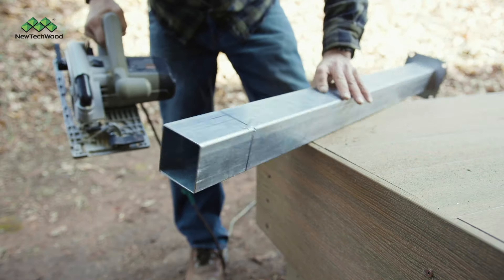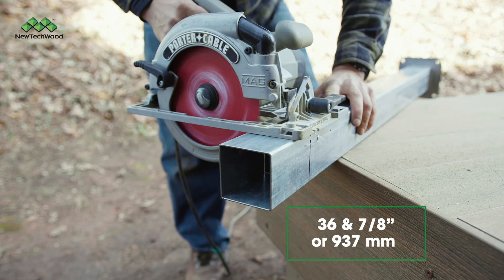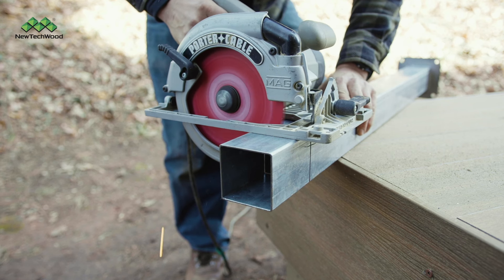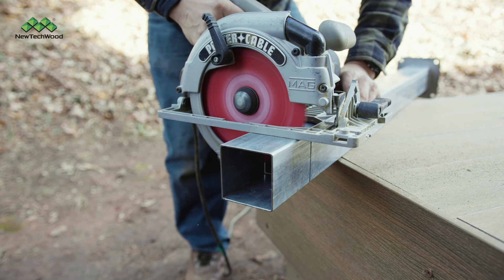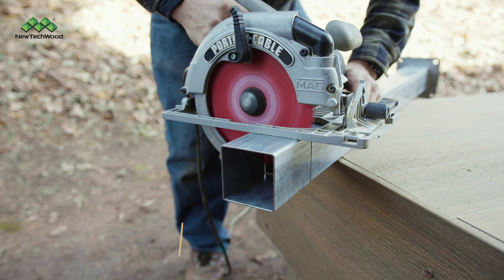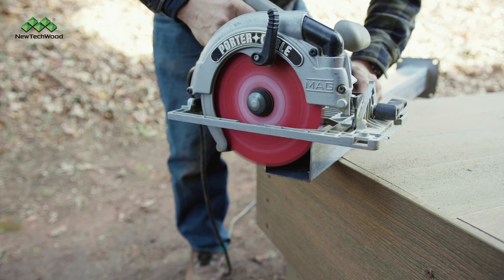Next, cut your post mount that will be on top to 36 and 7/8 inches. Due to the convenience feature of each railing kit being able to convert to a stair kit, it's necessary for us to leave the post lengths long. This enables the post to be cut for various stair angles at various heights in custom installations. Therefore, whenever a straight railing is installed, all posts must be cut.